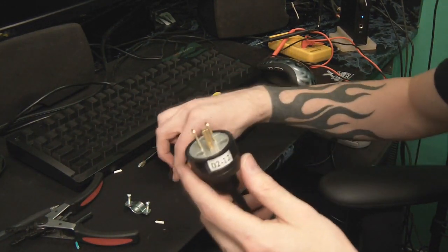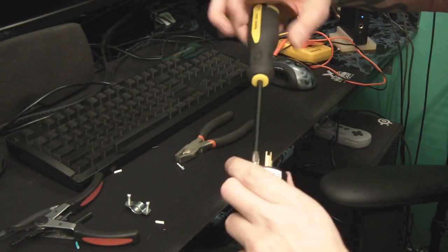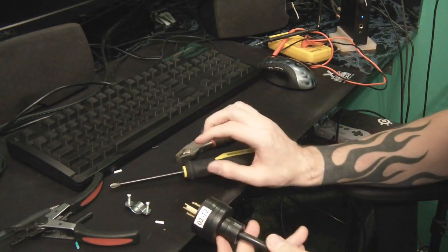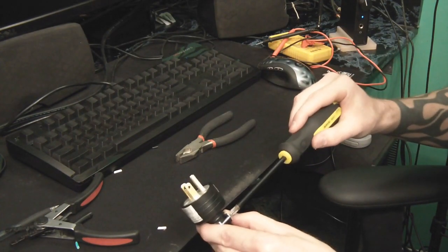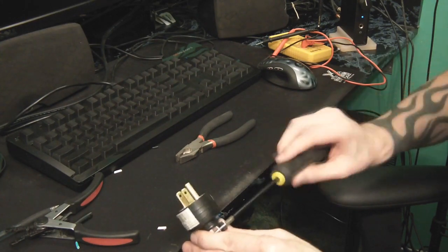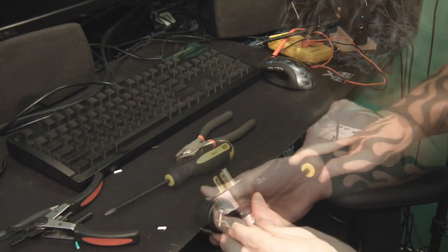The face is in and it uses three screws to fasten back down, so let's get these screws in there and get this finished. Tighten them down snug but don't over-tighten — it's not going to hold a lot of force, you just want it to be secure. Last thing is to get the strain relief in case the cable ever gets snagged or yanked. Tighten down one side and then the other, rotating back and forth — you don't want to over-tighten one side and cause an imbalance. You do want to get it tight though, because you won't hurt the wire by squishing it, and the tighter it is the more secure and protected it is against strain.